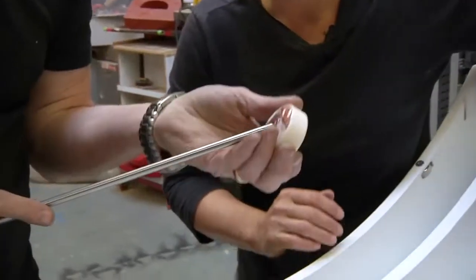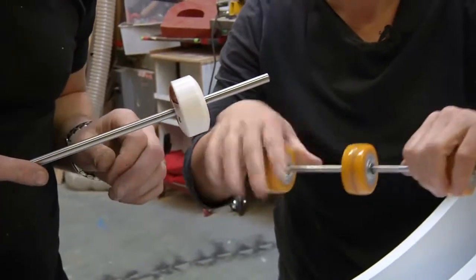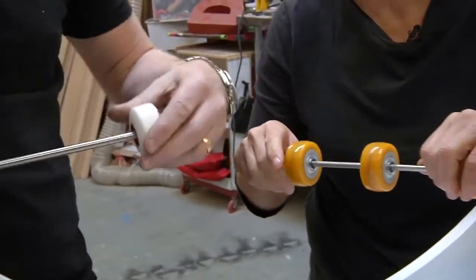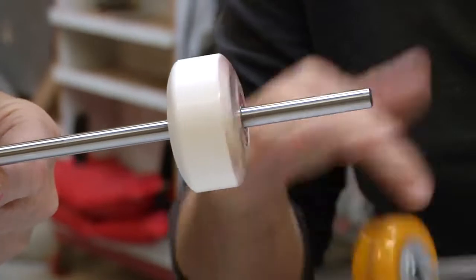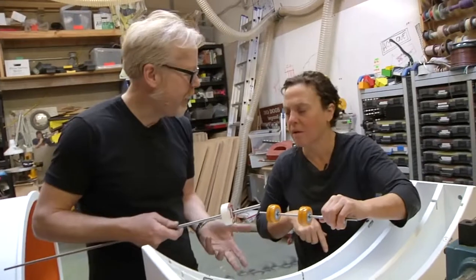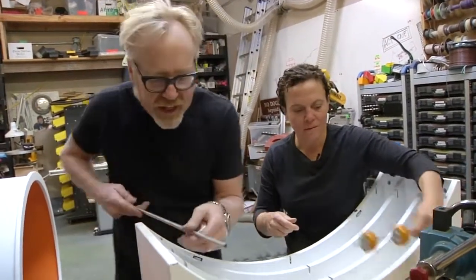In preparation, I bought this — a hard skateboard wheel and a thicker axle. Watch this — pick up that and spin it. You can even see the wobble on it. So go ahead and spin that one. Oh yeah, absolutely. And this one will spin for like 15 seconds. Right, and that one stops almost immediately. And times nine, it's a lot of extra vibrational noise.